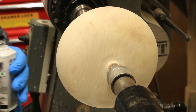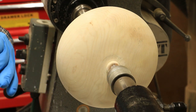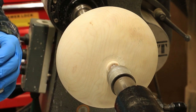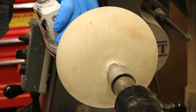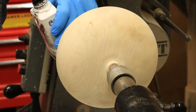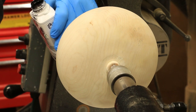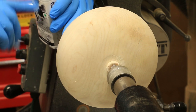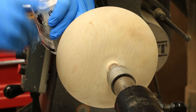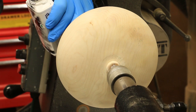Looking over a lot of different articles, they recommend bleaching the wood so you get a truer color. There are a lot of yellows in woods, so if you put a blue on there a lot of times it'll have a green hue because of the yellow. The one I've used so far has been Zinsser's two-part bleach. You put one part on with a foam brush, let it soak real good, then put the second part on to lighten the wood. Let it set overnight, then lightly sand it to get rid of the residue.